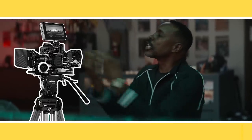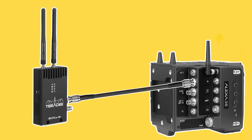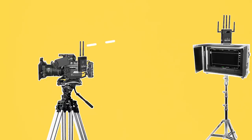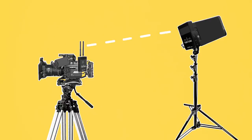Occasionally directors and focus pullers like to stand next to the monitor on camera, but more often than not they like to have a transmitted video feed to their own monitor. To set this up, we'll attach a wireless transmitter such as a Bolt 500 to the camera. Again, this requires two cables: a power cable and an SDI video feed. This Bolt will then transmit a live video feed wirelessly from the camera to a receiver. The signal is then either received by a VT operator at their station where it will be output to different monitors, or it can be directly cabled to a director's monitor or paired with a sidekick receiver that goes into the focus puller's monitor so they can see a live video feed of what the camera is recording while remaining physically separated from it.